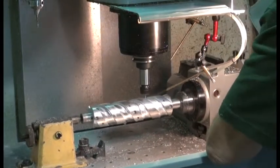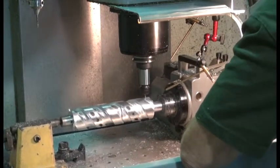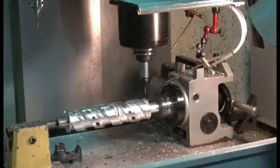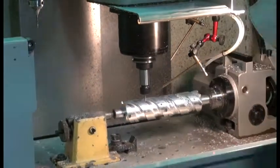Here you can see the wire guide being machined by the CNC. The CNC allows us to machine intricate designs, however the process leaves many sharp and rough edges. The wire guide must not have any sharp edges as to avoid shorts during the winding process.